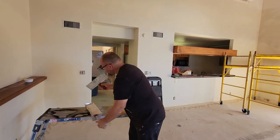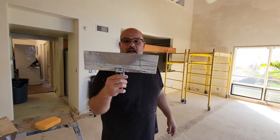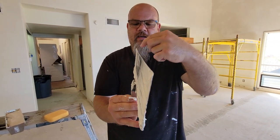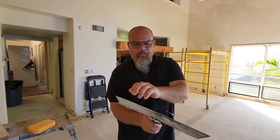Here's the biggest tip I'm going to give you. This drywall knife — it's a happy accident I learned a while back. If a drywall knife is straight, you tend to put lines on the edges. What's helped me most is I've bent this knife. This corner is bent this way, this corner is bent this way, so when I look down it, the knife is going like an arch — it's concave. It's an arched trowel. I just bent it with my hands, and what that does is it makes the high point this hump, so when I'm troweling it on the wall, I don't get a bunch of lines.